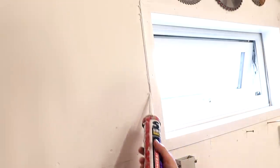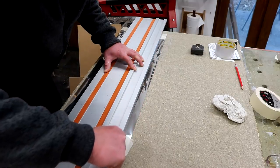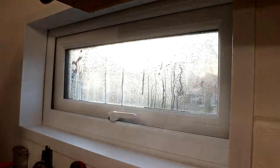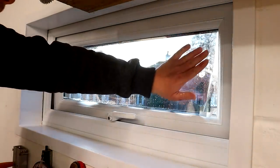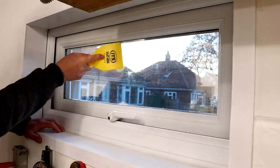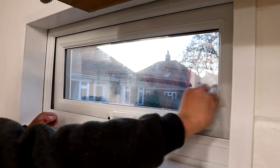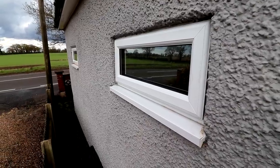I gave them a coat of primer and a couple of coats of paint, then I can add silicone around the inside of the mitered frame and push it in place. I sealed it on the outside too with some decorators caulk. Finally I'm going to add some reflective film onto the windows - I had this on the old windows too and it means that no one will be able to see into the workshop from the outside but I can still see out, so it's just a security measure. After spraying on lots of soapy water you can just offer it up and I used a plastic tool to push out all of the water and any air bubbles. I got the reflective film from Amazon and I'll link to it in the description box.